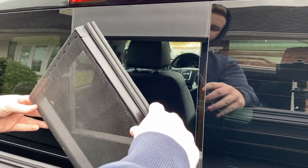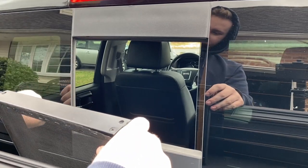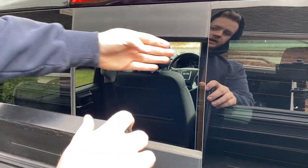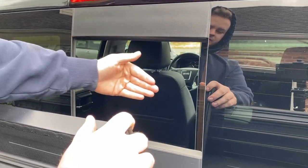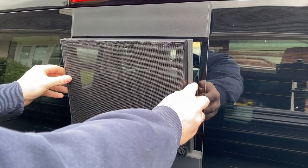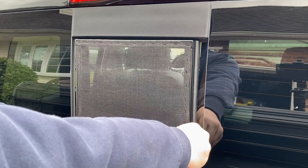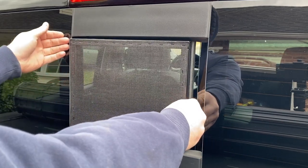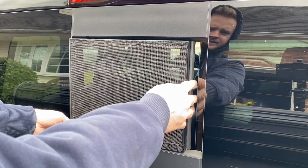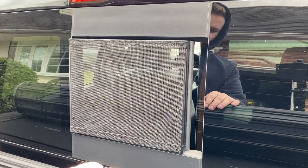Since you last saw this I did make one change — I moved the weather stripping to the inside edge, because the glass is the perfect surface to seal against. This side has it on the outside edge, and the other side will go against the sliding window itself, which is offset inwards a little bit. So with one strip toward the inside edge and one toward the outside edge, they line up pretty well. I'll push this in here, take the left edge and put it on the glass — one strip of foam on the outside and one on the inside — then line this one up with the sliding window and shut the window on it.